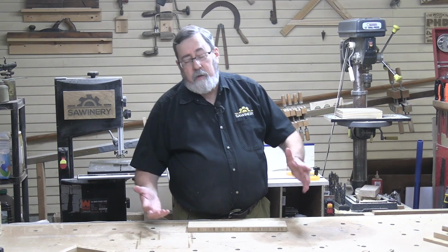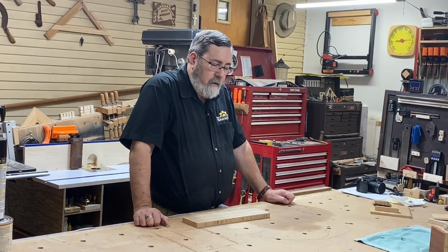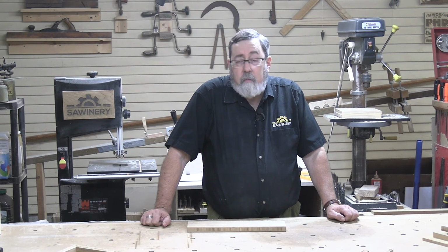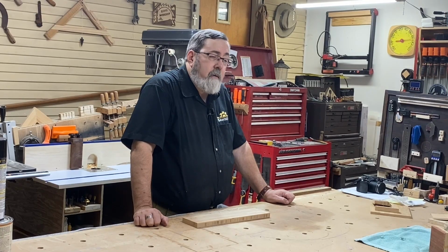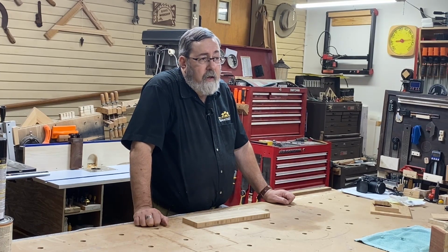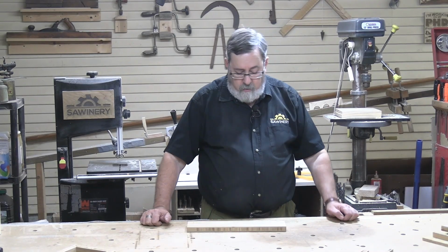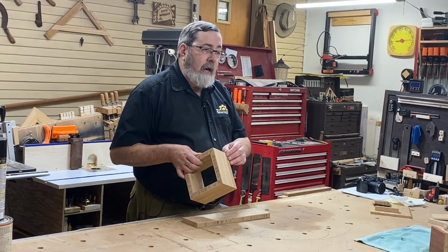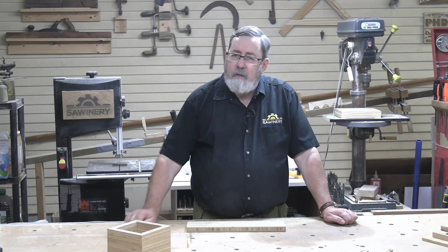Now, does that mean I would switch over to it? I don't know. You know, looking at things a little differently and thinking about them a little differently. You can work it pretty much the same as you can pretty much any wood, at least from what I've been able to see. And so that's good, and that's in its favor. We've got the same end grain issue that we do with any plywood, and we'd probably have to deal with it the same way, in the sense of putting some sort of banding on the end grain, or trying to design things in such a way, like using miter joints so we're hiding the end grain, things like that. But those are the types of things we deal with regularly anyway.